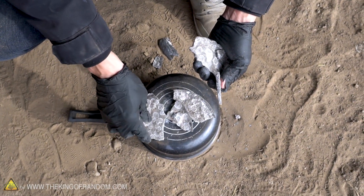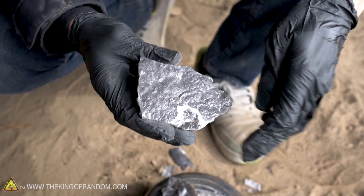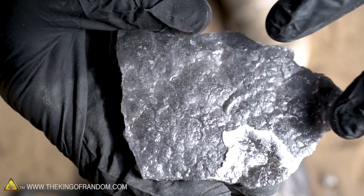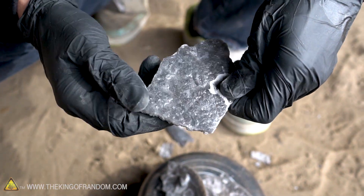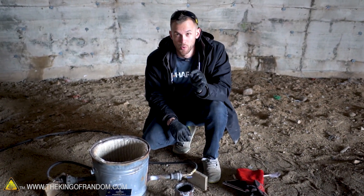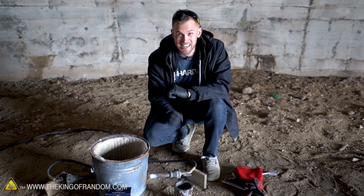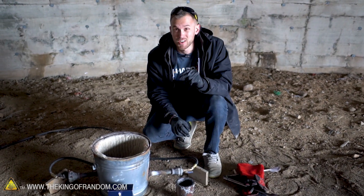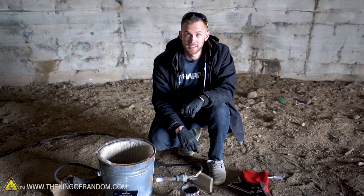Not very durable — I can pretty easily just break it in my hands. And it doesn't really seem like it takes the shape of what I poured it into. This is the bottom, and our pot is pretty smooth on the bottom, but we've got lots of bumps and wrinkles and spots where it looked like, as it cooled, it sort of contorted a little bit. So unfortunately, I don't think salt will make a very good casting material. I've got one more test I feel like I need to try, inspired by poking that piece of poured-out salt with our icicle and watching how much it hissed and sizzled. I'm going to try melting down some more salt and then dropping a piece of ice into the molten salt to see what will happen. I suspect that the ice will turn to water and then to steam so fast that it's going to make the salt spray out, so I'm going to make sure I can stay at a good distance away as I drop that ice cube in there.